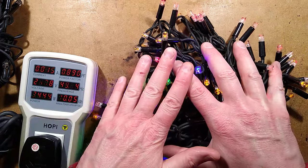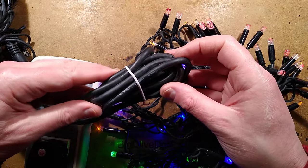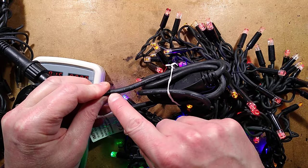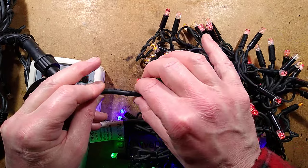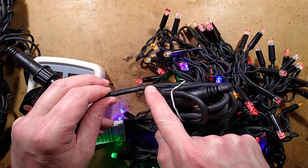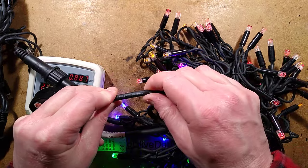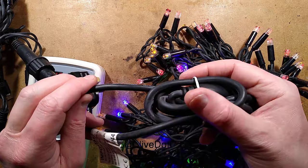The cable is made of rubber. The flex is normally called something like HO5 or HO7 — typically the main wiring for trees will be HO7, but in this case it's HO5, which is rated for lower voltage and is a thinner cable. The voltage rating really determines the thickness of the rubber. It's a TRS — tough rubber sheath. HO5 is fine for these; it's a rugged, extremely abrasion-resistant and ultraviolet-resistant cable, making it ideal for outdoor use.